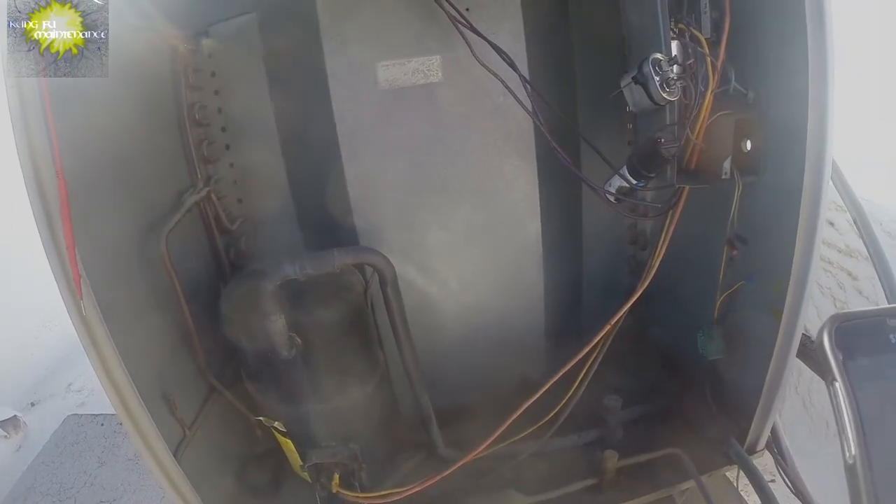I've looked this one up before. I'm going to discharge the capacitor — the capacitor holds a charge in it even after the power is disconnected. It looks like it might have a 45 on it, which is probably not correct. So let's go to my list here that I've been compiling.